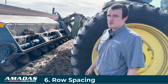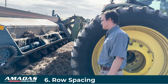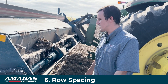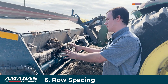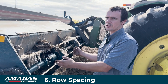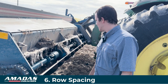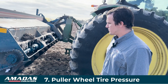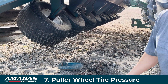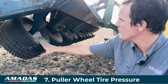There are a couple of adjustments you can make to the machine to maximize performance. The six-row machine has adjustable row spacing, so you can move the gearbox or the whole puller units for either 36-inch or 38-inch row spacing — the details of how to do that are in the operator's manual. For performance in the field, the tires are what grab the stalk. You generally want to start out with a pressure of 26 psi, which is what it comes with from the factory.